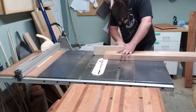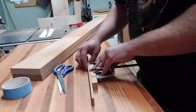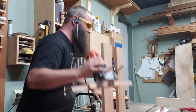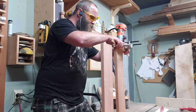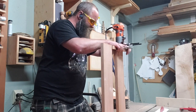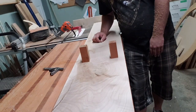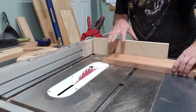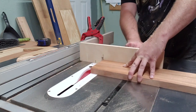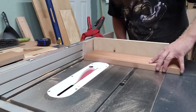For the rails or aprons I'm using some pieces of African mahogany left over from my coffee table build — there's a link to that in the description if you're interested, it's like a five-part series. These aprons are almost six feet long so I had to get up on a little step ladder. I put a little spacer on my router fence, and I eyeballed how long I wanted the end aprons and cut those to length, then routed the mortises in those too — they were maybe five inches long.